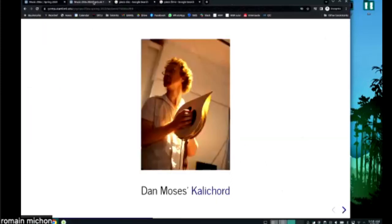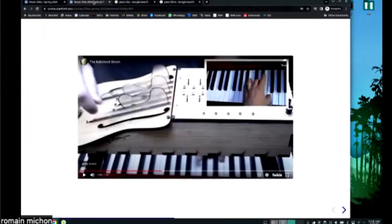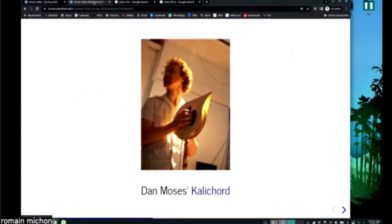And then for his final version, he decided to go with piezo discs because it was more practical to glue piezo discs to these plastic tines. But piezo films are actually pretty cool if you want to make this kind of instrument. They're very hard to solder because they melt. So if you solder them, you have to solder very, very fast. Otherwise, they will just melt.